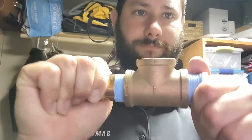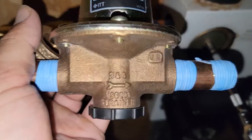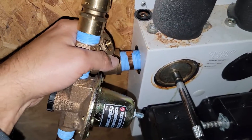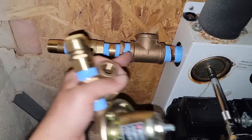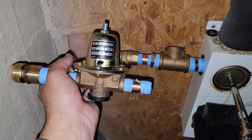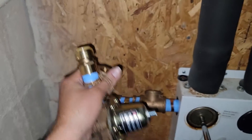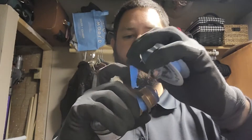It's all coming together. Get a few pieces together and then I'll start inside. This is the reducing valve — make sure you take into consideration the arrow. You'll need the water supply to go in line with this arrow and then to the flow center. On this T right here we're going to put our pressure gauge so they can read pressure. This is our shutoff valve so they can turn it off and then read the pressure if they want. I've got an elbow here and then that'll be our SharkBite fitting. I'll run PEX from that SharkBite fitting up there. I'm going to start tightening this up — got to get the Teflon tape on the pressure gauge.